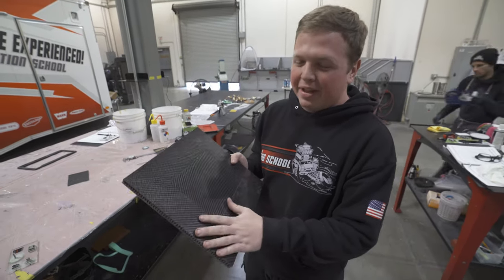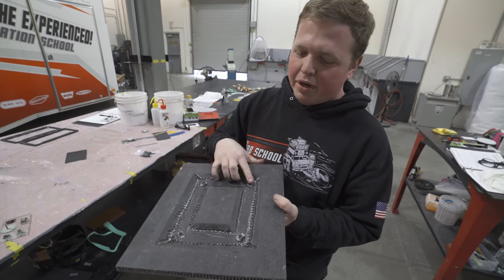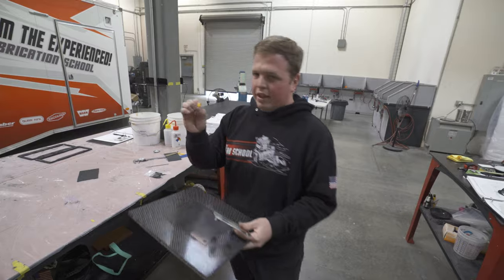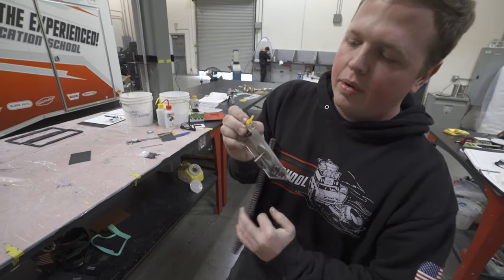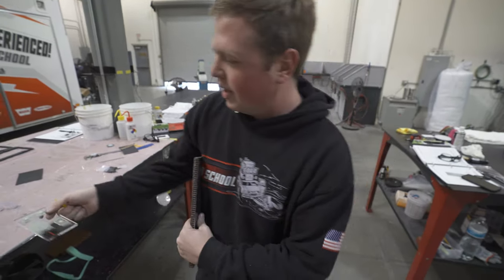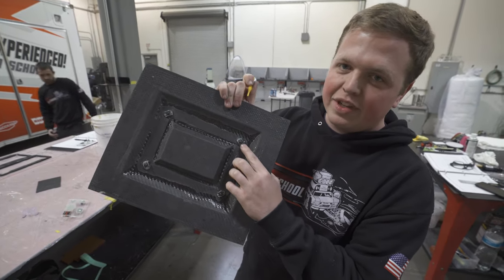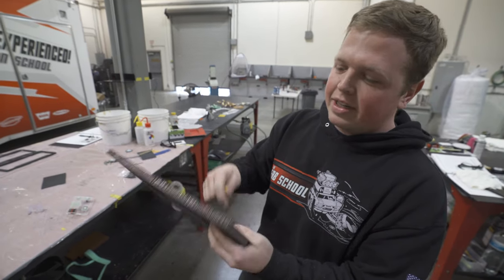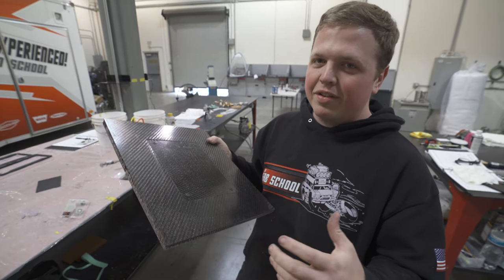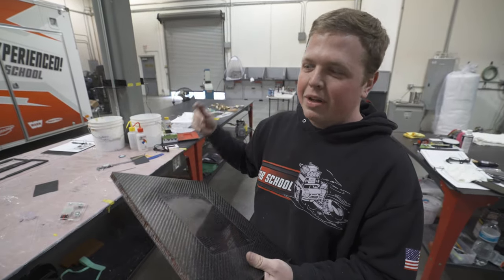Imagine this is a plane — this could be the fuselage or the wing. Sometimes the back side's enclosed and you can't get a wrench on there to put a nut on. That's where these Clickbond fasteners come in — they've got these that go through them. This is all one piece — you put your glue on the fastener, pull it through the hole, and it glues your fastener in place once it cures. You have a nut on the back side that you don't have to get a wrench on — your nut's permanently affixed. So if you need to get in to inspect certain places on an airplane, just put some of these in there and you can just unscrew it — no wrench, no permanent cutting.